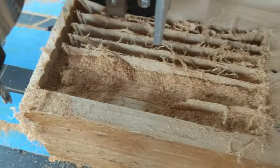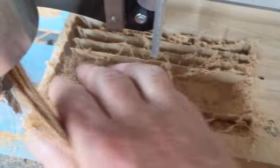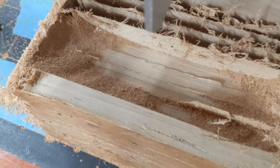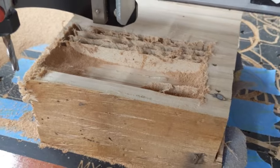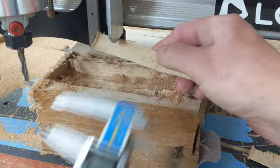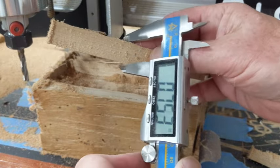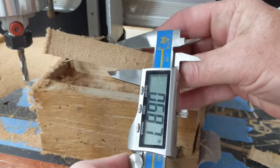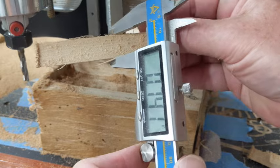This is typical when you're pushing a benchtop CNC router this hard — not just the Long Mill, but most benchtop CNC routers are going to do this. They're not built for a lot of robust work like an industrial unit is. But you can see we actually cut three quarters of an inch deep on this in one shot, so you know the router bit can handle it.